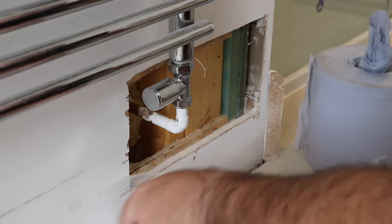To get the pipe in behind the plasterboard I need to remove some of the timber I've come across. I wouldn't recommend taking out any structural timber from your house, but I don't think a little bit like this is really going to affect it. With the pipework in place, I can reattach the towel rail to the wall in its new position. Ironically, the two fixings on the right-hand side screw straight into the timber structure I came across and had to trim, which actually gives me a really good fixing to the wall.